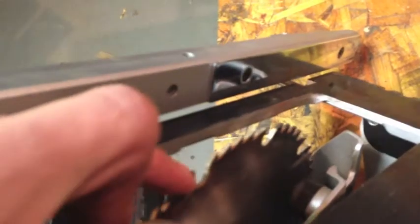Alright, so got it set up. It's just about 1.5 inches between the blade. I traded the blade out for the 5 teeth per inch one, figured I might as well give it the best shot we got for the first time. Reclamped it so that I got a better area with the saw, and I got my fence on there so it's nice and even now and it will slide nice. I still got the protective covering on there. We won't pull that off until we're almost all the way done. And so let's give this cut a shot.